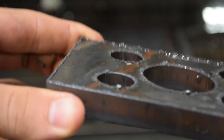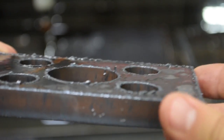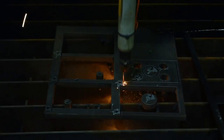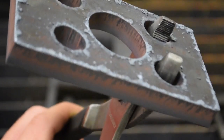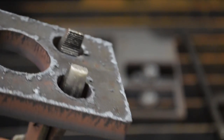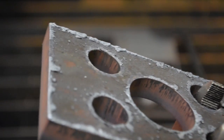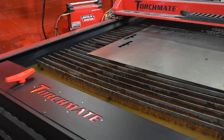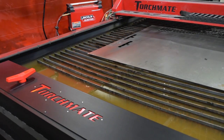In this example, we saw noticeable differences in the amount of dross accumulation when cutting half-inch mild steel at two different water levels — one with no water in the table, and one with water touching the base of the plate. Circular parts exaggerate the difference in dross accumulation, whereas straight cuts show smaller differences. Having a higher water level also decreases the amount of downtime in waiting for parts to cool and decreases the risk of being burned.